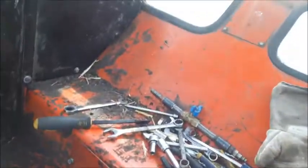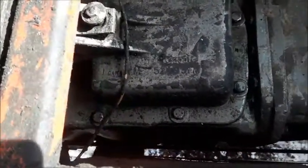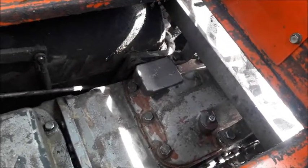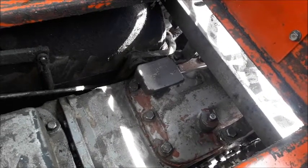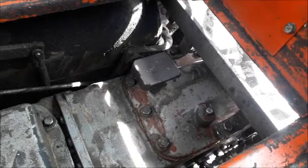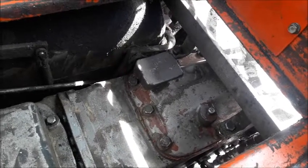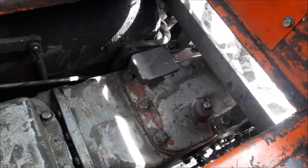We got the floorboard out on the Massey again. That's the lift cover for the rear end, and that's the transmission there. We plugged the gauge into the back — we don't have very much pressure. We got 500 pounds idling, 1000 pounds picking up a lift of 2x4s this morning, and 1500 pounds lifting a 6-foot-plus straw bale. We're not getting up to the 2300 to 2600 psi we should have, and we already changed the filter.